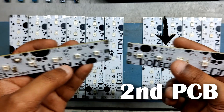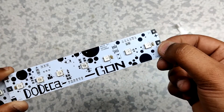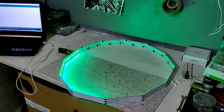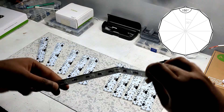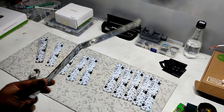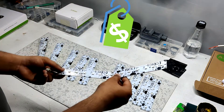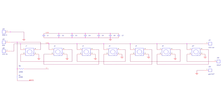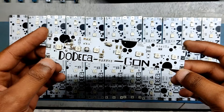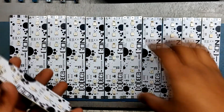This is the second PCB we're going to need. It doesn't have an ESP12F module soldered on it — it's just a breakout for 7 RGB LEDs. My idea is to solder 12 PCBs together, each at an angle of 150 degrees, just like a classic dodecagon shape. So overall this project requires 12 PCBs: 1 main board and 11 LED breakout boards. But buying 2 different PCBs would cost more, so I prepared this setup so that if I need to use the ESP12F on the bottom side, I add a 0-ohm resistor which connects the DIN port of the first LED with GPIO12. This way we only need to add an ESP12F to one board and the rest can be directly soldered with WS2812B LEDs without changing anything.